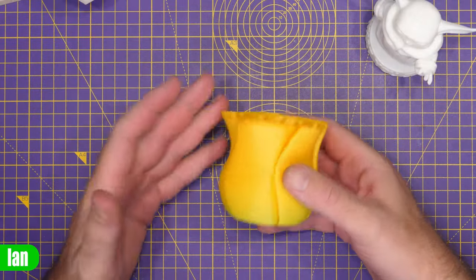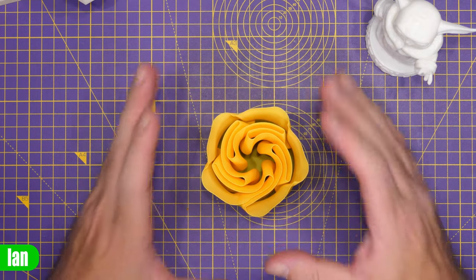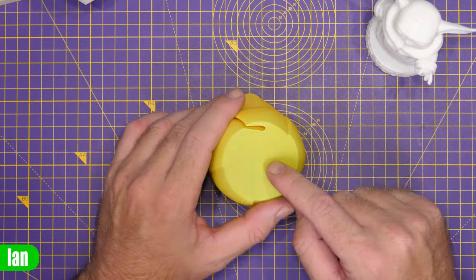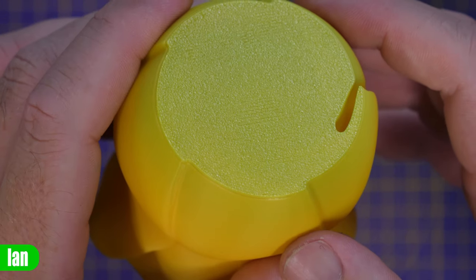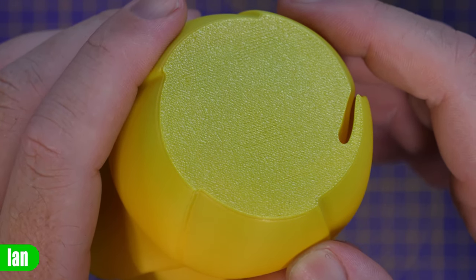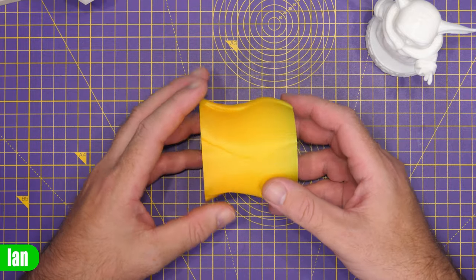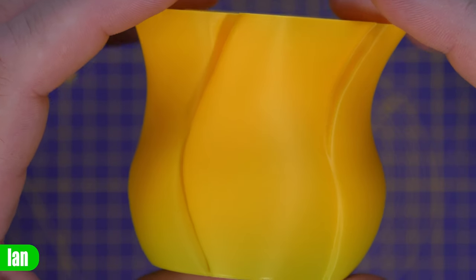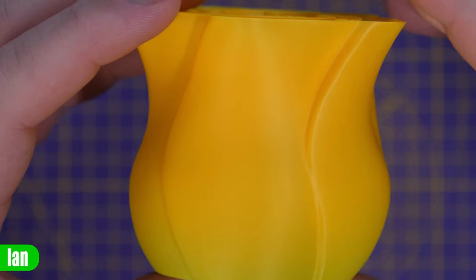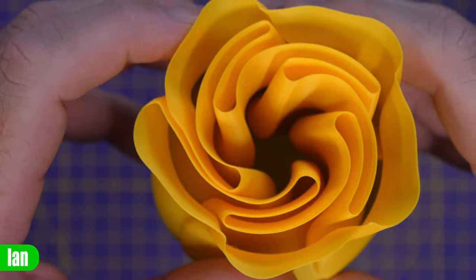Starting with this rose — it's a vase mode test print I use on pretty much all printers just to see overall how the printer behaves. The bottom layers come out really nice, although there's a small area in the middle where it hasn't quite squished in enough — I didn't quite get the Z adjustment right. But other than that the print has come out really nicely. Very little ringing compared to other printers, no errors, no zits. Really nice and smooth.